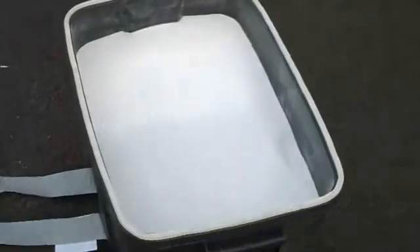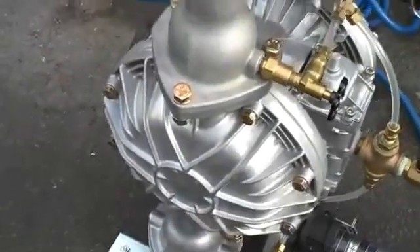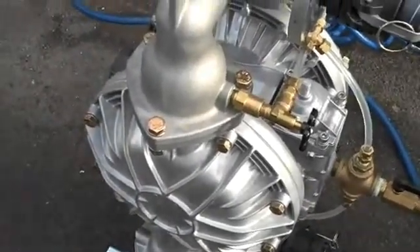What we've got is Daniel here. Daniel's holding what we've got is a mock-up suction lance. The lance is literally just a piece of pipe, available just about anywhere. The point is we don't ram said pipe into this powder, or you get slugs which go up the pump and end up in the liquid chamber. They can damage the pump and actually bend the shaft, so we keep it nice and aerated, nice and fluid. Another help in hand is this one-way valve, non-return valve on said lance.